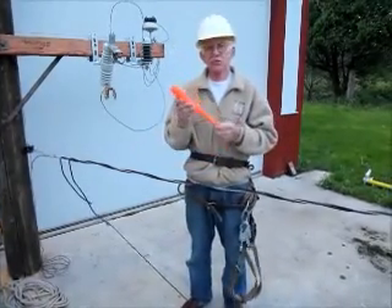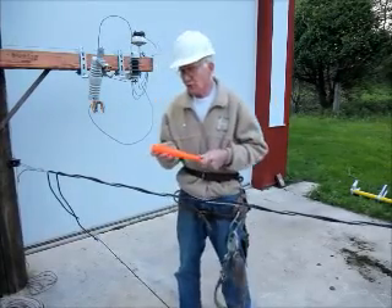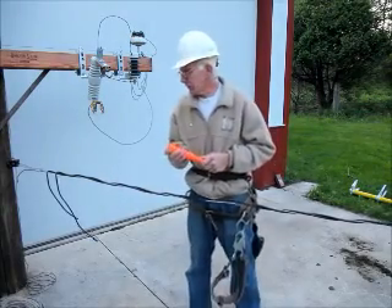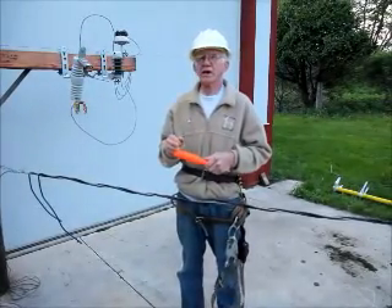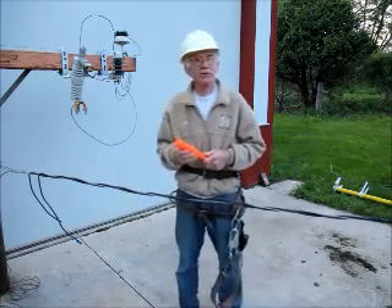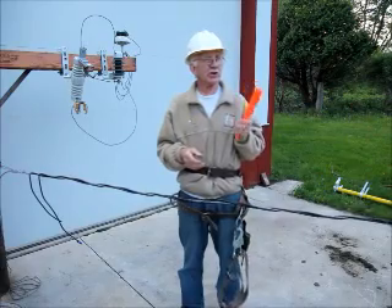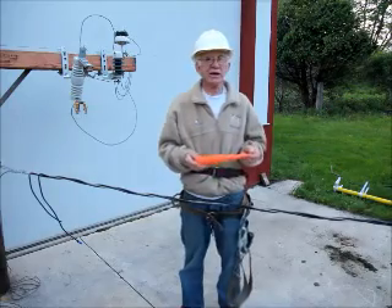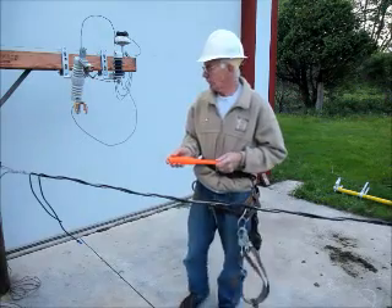This tool is a safety tool. It's made for eliminating short circuits and ground faults. In the 42 years that I did line work, I probably had a half dozen close calls, and most of them were because of a screwdriver, or getting my hammer or a wrench or some metal tool in where I shouldn't have. Any time you can use this — there's no metal in it — you're not going to have any burn-up parts.